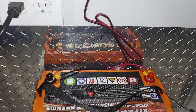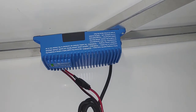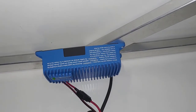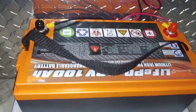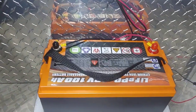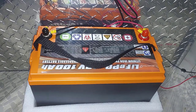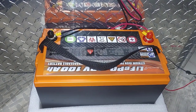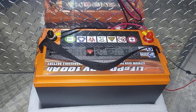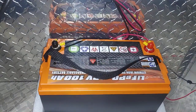When I turn on my lights in the WeRoll like I have on now, it's actually charging a little bit when I'm connected. When I'm disconnected on the road, this gives me plenty of power. I could also put an inverter on this and run my refrigerator for a short amount of time — a day and a half I've calculated. So those are the two systems in my WeRoll: the 12 volt and the 110, including the Victron charger and the battery I ended up going with.